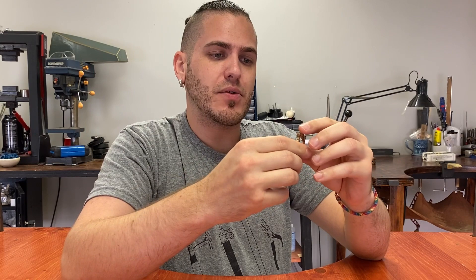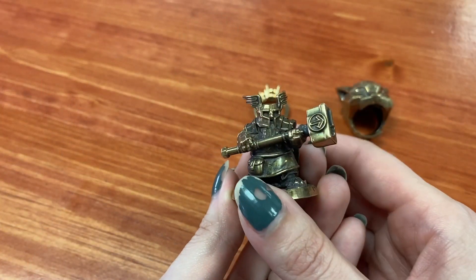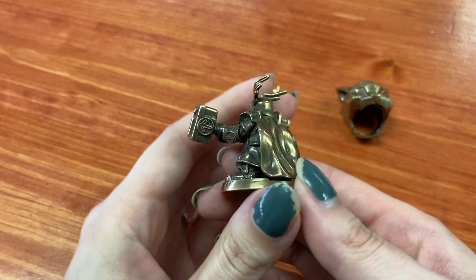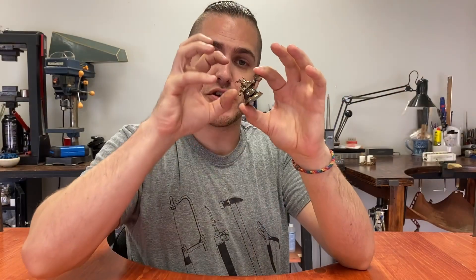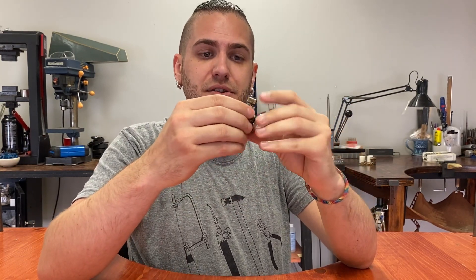You may want to adjust this temperature by plus or minus 100 degrees Fahrenheit, but not by any more. If you're casting a very thin model — something like a standard jewelry store type ring or even something thinner — you may want to increase that temperature, so let's say 1,100 Fahrenheit. What this does is it allows the metal to stay fluid just that instant longer and be able to get into all those details. If you're casting something heavier, you may actually want to lower that temperature — so you might want to go to 900 Fahrenheit — because when you pour such a large mass of metal into a space, it stays fluid for a considerable amount of time and doesn't need as much help to get into the details. And there's a shrinkage factor that happens that needs to be considered as well.